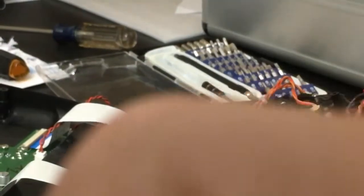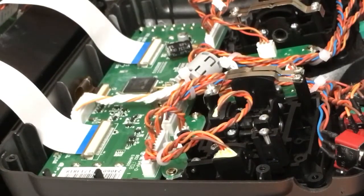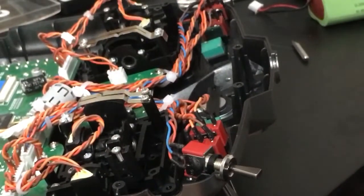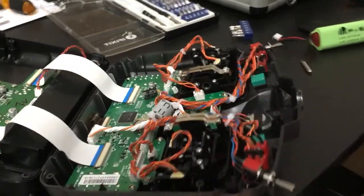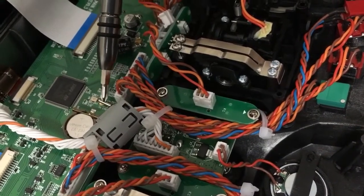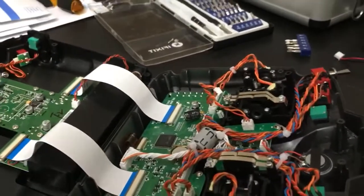So basically what I have here is essentially an SE model. The only things different: I have the ferrite cord and the capacitor, but I don't have the upgraded switches and I don't have the SMA removable antenna — which is not what I wanted anyway. So for $40 I can put the gimbals in myself and possibly avoid that transmission problem people are reporting. One thing that does surprise me is this oscillator here — I would expect this to be glued down or soldered down with that ground pad right there, but it's free floating. That concerns me. This may just be a cheap clock oscillator for the on-board internal clock, but still — if you're going to do it, do it right.